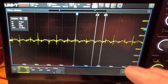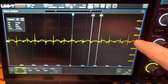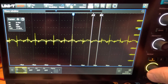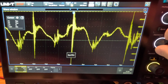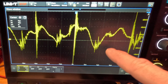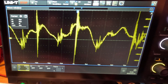I'm not using the 20MHz bandwidth limit here, but for those who've measured power supply noise, the noise is very low. The spikes peak up to around 200 millivolts, but the actual meaningful ripple is the low-frequency charging and discharging of capacitors — that's the switching-frequency ripple. Zooming in on the low-frequency ripple: about 20mV below to 40mV above center, so roughly 60 millivolts peak-to-peak. Pretty darn good. This scope is incredible.